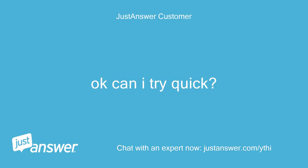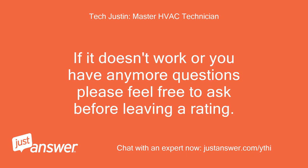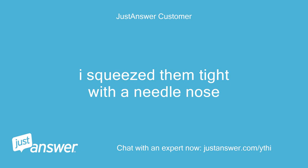Okay, can I try quick? Sure, if it spins backwards, switch brown and purple. When we are finished, please leave a rating. If it doesn't work or you have any more questions, please feel free to ask before leaving a rating. Okay, the fan didn't spin. I used the clamps to connect the brown and yellow together, is that good enough? I squeeze them tight with a needle nose.